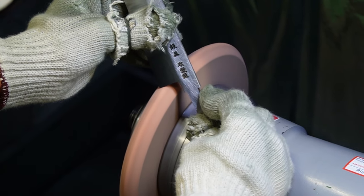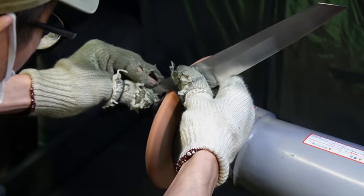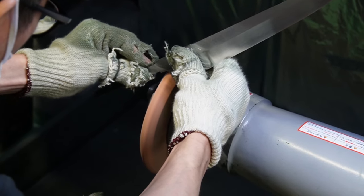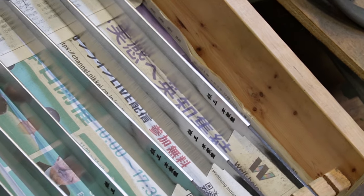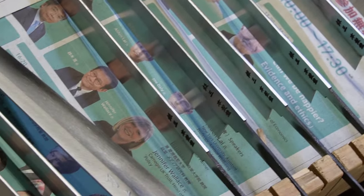Another thing that makes the Hado knife stand out is the rounded heel, and Maruyama-san told me that this is one of the most difficult processes in making a knife. They use a small vertical grinding wheel that is already shaped at a certain angle, but the problem is that it grinds very fast — if you hold the knife a little too long the whole blade will be ruined. Still, the Hado masters know how to do it, and in the end we get beautifully finished knives with perfectly rounded heel and back.